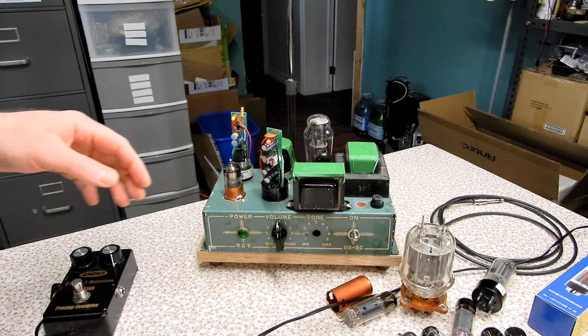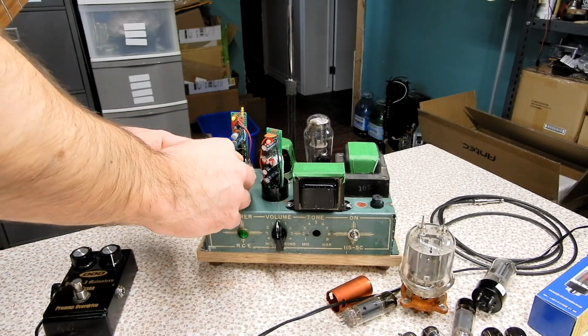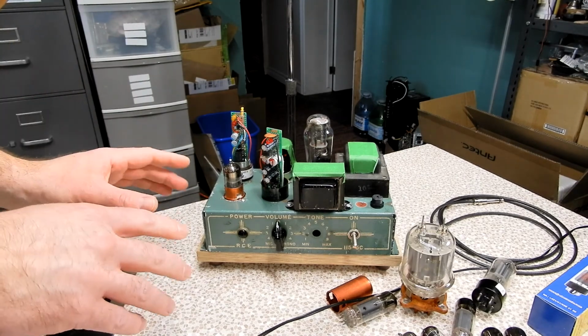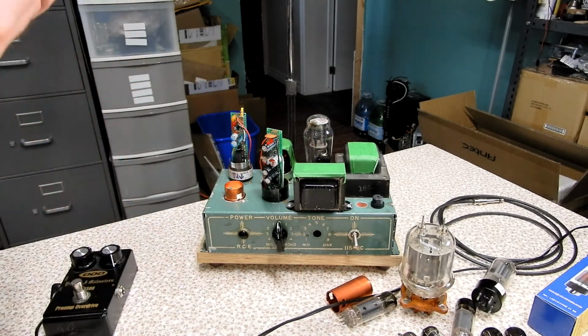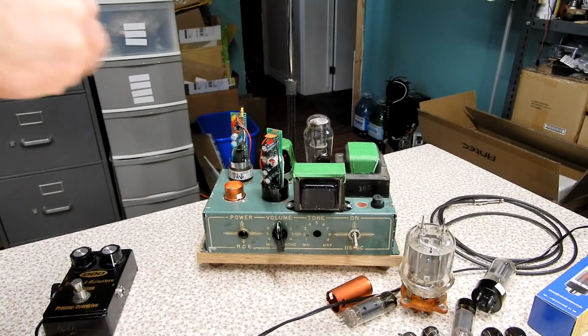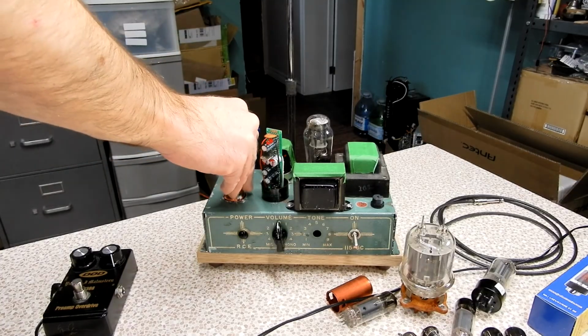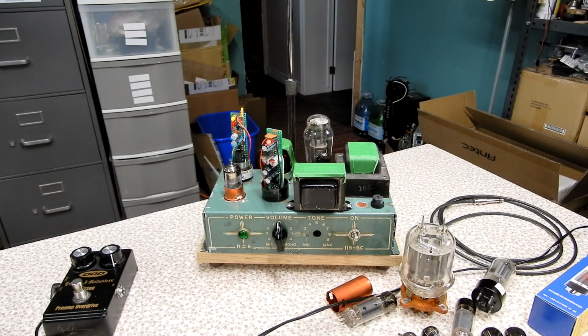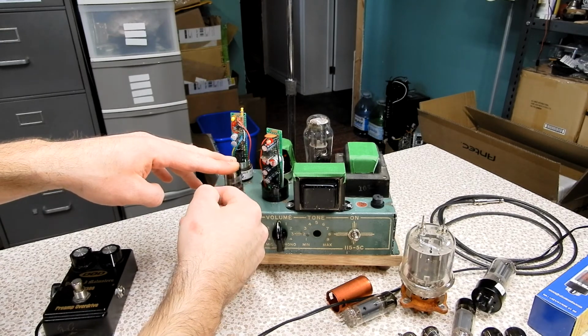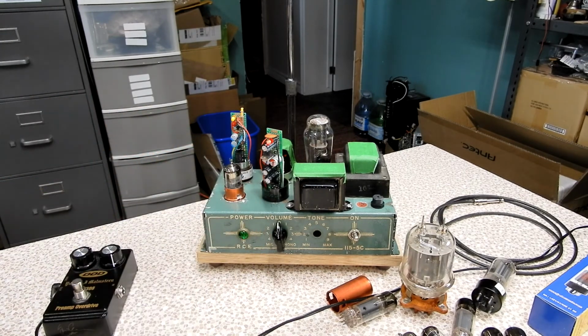Oh, is this tube defective? Okay, let's reference sample here. Wow, get out of there. Do I have a defective tube? I'm gonna have to compare. Let's grab a different one. Noisy. Okay, these guys are definitely noisier. That's a high sensitivity V1 position. And there's microphonics.